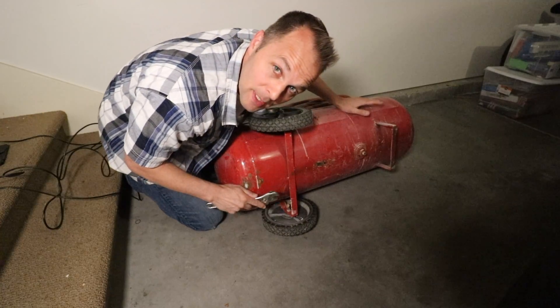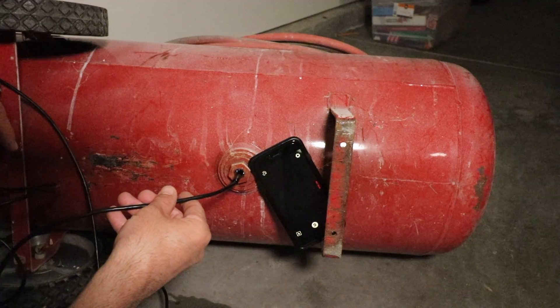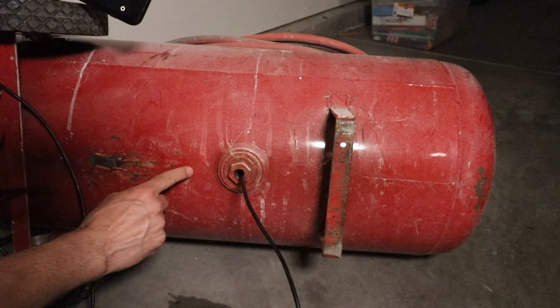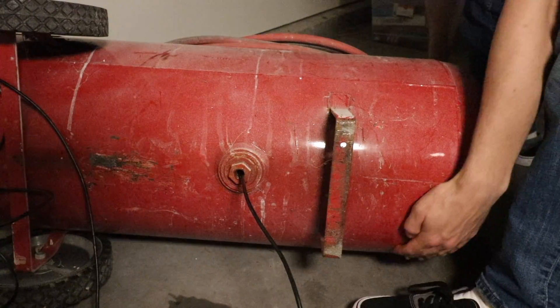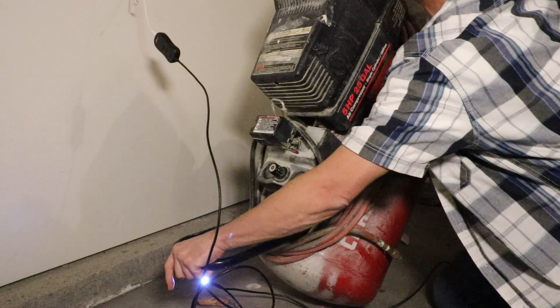Let's look inside this tank — it hasn't been drained in a long time. You can see how wet it is in here; all these rust spots are weakening the walls and it'll blow if it gets too weak. I tip the tank to get the camera near where the sediment would be — it looks like a pile of sludge. The tank should not look like that. You don't get a super clear view, but if you're using this tool it usually means you're pretty desperate.